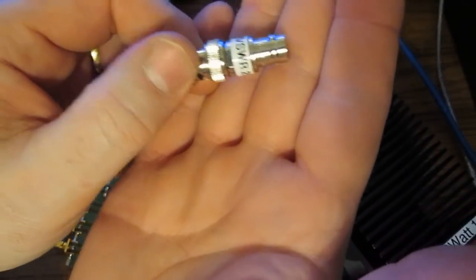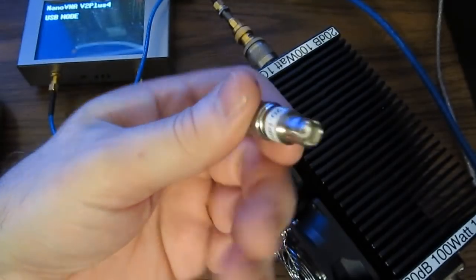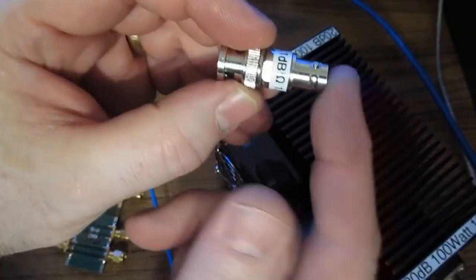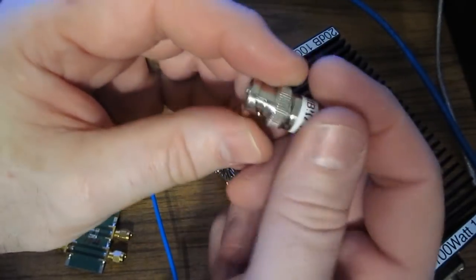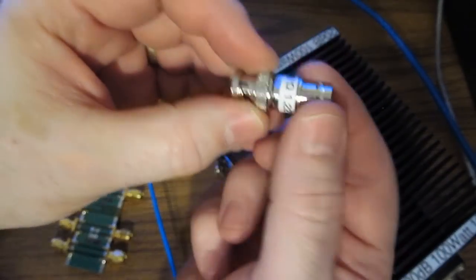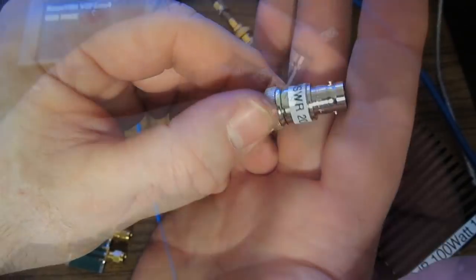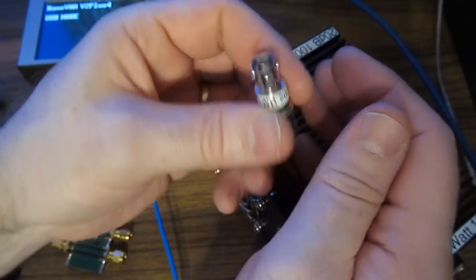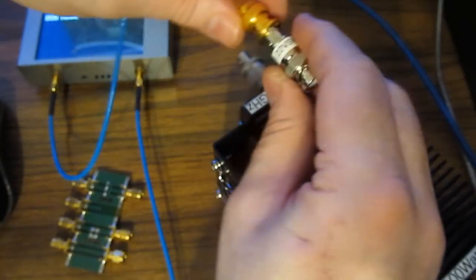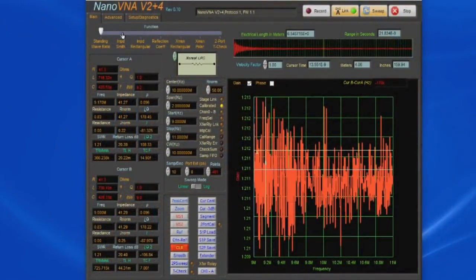antenna, and we're going to do that by inserting this little device. This is a 230 ohm resistor. It's actually 4 1206 resistors in parallel, and again they attach to the outside shield, so it's essentially 230 ohms between the center conductor and ground. This will create an SWR of 1.22 to 1. It should also cause a change of about 20.1 dB. So let's go ahead and attach that. Again, we'll just go between the network analyzer and our load, and there you have it.